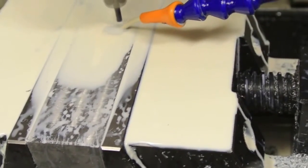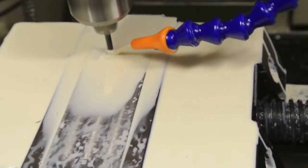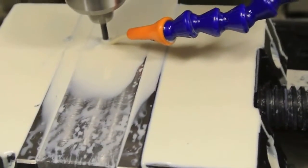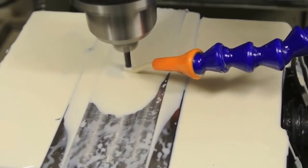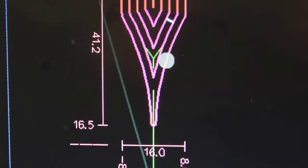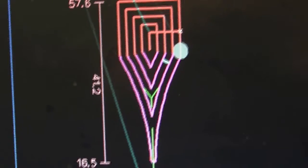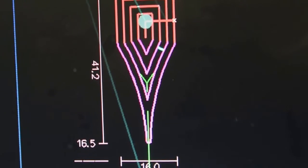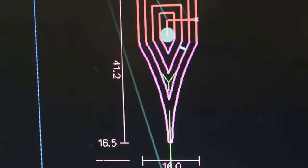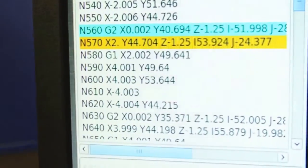Once that's done, I will pocket away part of it so that I can sit the component flat on the flange — on the underside of the flange — and machine the top part while it's gripped. Here you get some idea of the shape of the component. It's just coming around. I've just checked it was cutting correctly, so it's coming down for a second cut now. There we go — you can hear it's cutting. There you see the cutter sitting through.